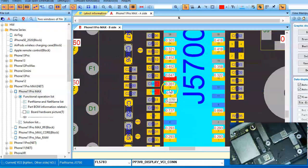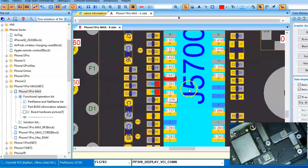It's a big thing. I think if you're serious about micro soldering, then you have to get the ZXW Tools software. These red numbers are the diode mode values — it allows you to go down each of the pins. When you're doing diode mode, you have to make sure that the battery is disconnected and there's no power going to it, otherwise you're going to short something. Disconnect the battery, go down each of the pins, and compare the value you get in diode mode to the value you find in ZXW Tools.